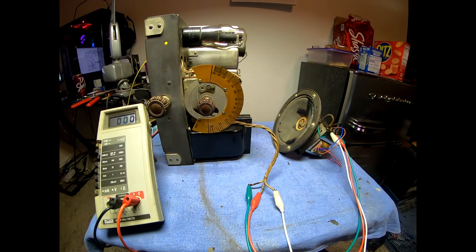The next step will be installing the new electrolytics and their mounting points, then going through and replacing all the resistors, and then seeing if we can actually get this thing to receive broadcasts, or at the very least pick up signals from my generator.